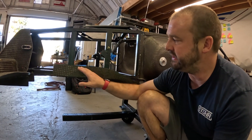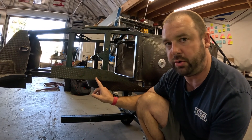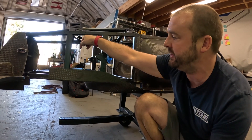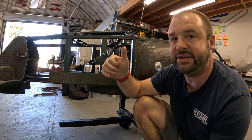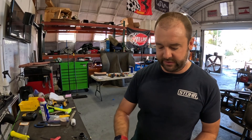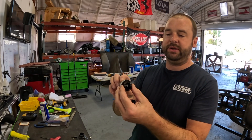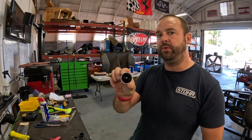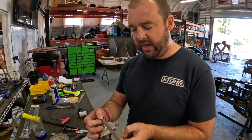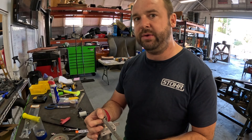From here you can see that this is just one piece of carbon, but we need to put a pretty large hole here for my steering rack and a smaller hole back here for my lower control arm. That tied in with the actual holes we need to drill down from the center of the car for my steering rack and my brake pedal assembly. We also have to consider the mounts for the end of the steering rack, and conveniently if I get my job done just right, that should also work with my inch-and-a-half hole saw. The center point for the rod for the steering rack is an inch and a quarter above the flange surface.